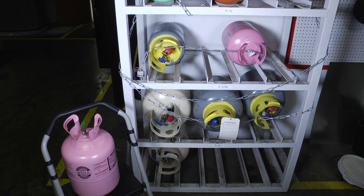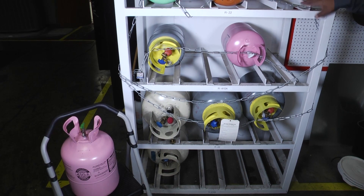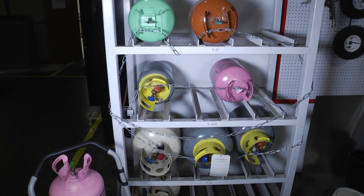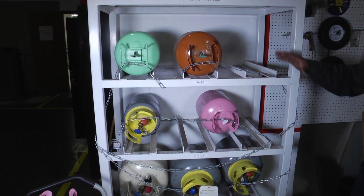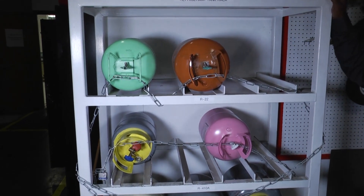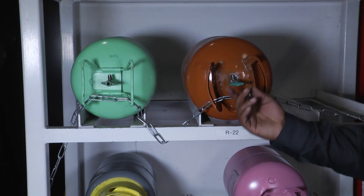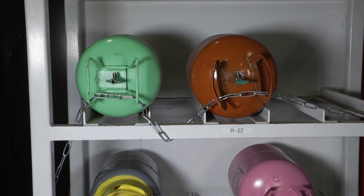The other thing we want to do is once we finish with that tank, go ahead and load it back onto the truck. People have all different types of storage methods, but one thing I'd recommend is that you definitely want to secure and strap your tank down so that it doesn't roll or move, and so we don't have something that accidentally hits one of the valves and causes refrigerant to leak out.